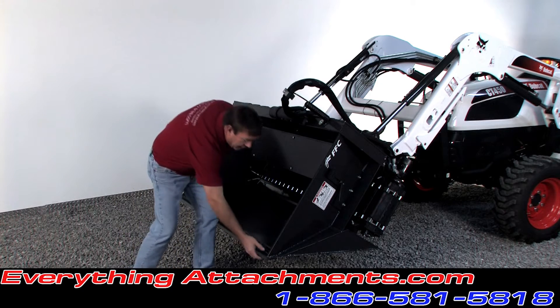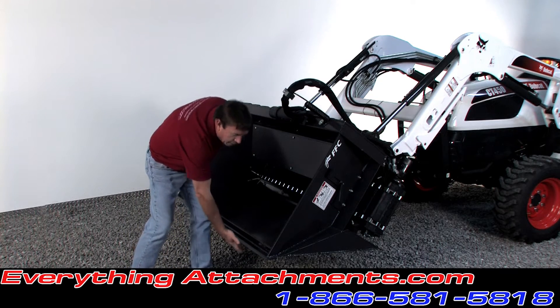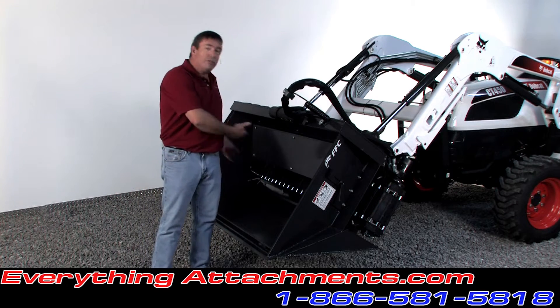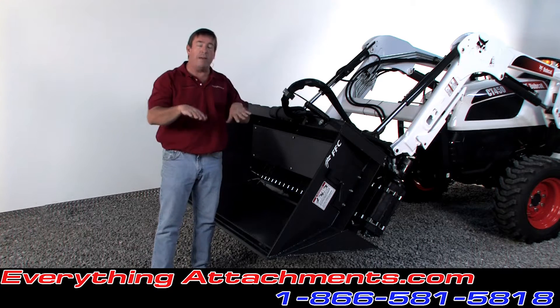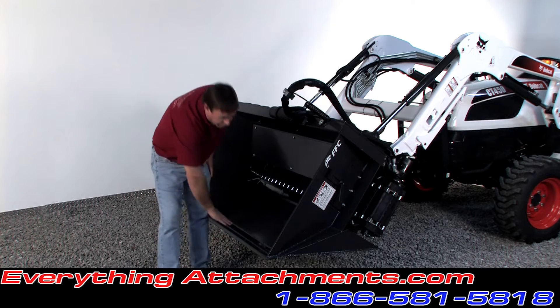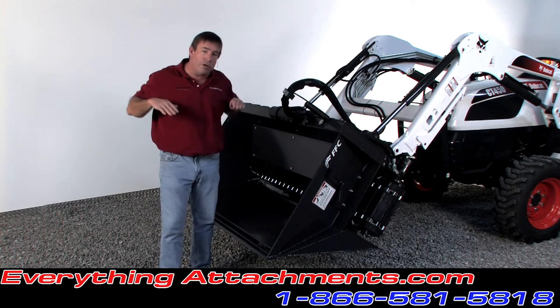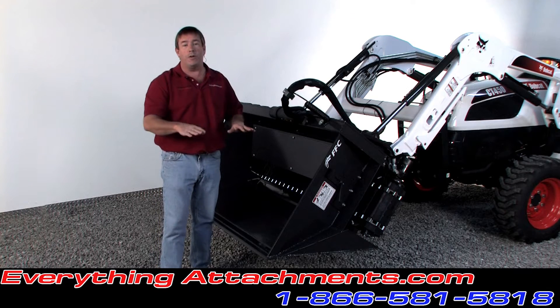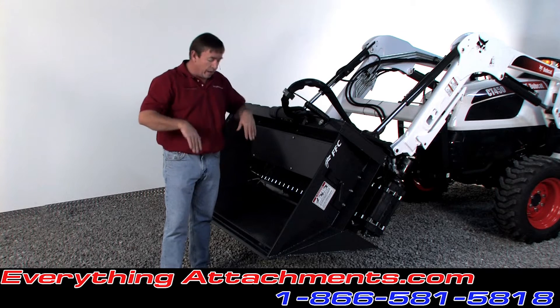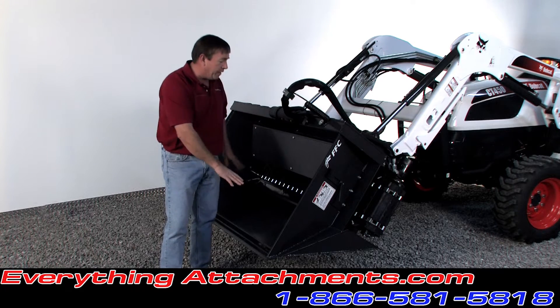This bucket has the ability to put on the double cutting edge, so if you were going to be scraping up gravel to side discharge and scraping onto cement or something, you would want to put that extra edge on there so you're not wearing that. You can use it as a bucket to load — whether you're doing sand or whatever for wintertime salt — and scoop it up so that it protects your edge.